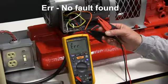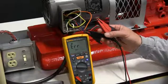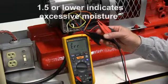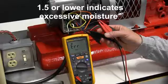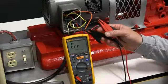Again, you can see that this motor is in good condition. A low polarization index — typically 1.5 or lower — would indicate excessive moisture or contamination. In this case, we have a good motor with good insulation and no moisture intrusion.